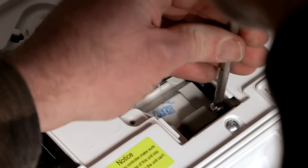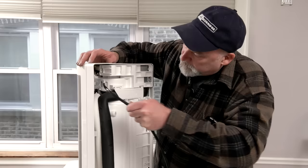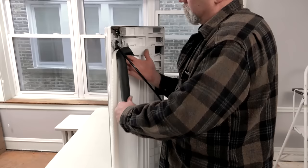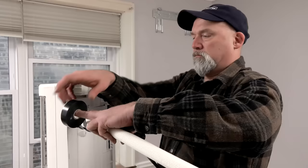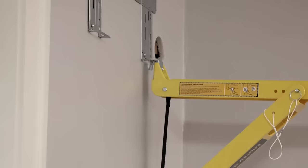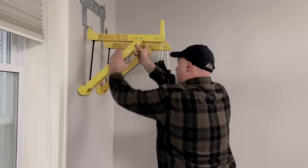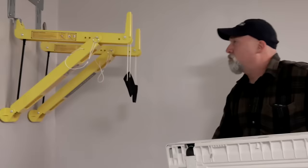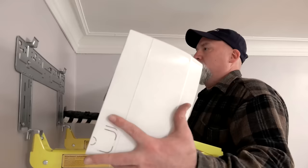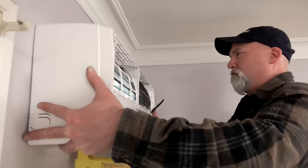Prepare to install the control wire by removing the wire cover and wiring clip. Push the color coded multi-conductor wire through the inlet hole on the back of the air handler and pull a few inches through the front. Leave the cover open — you will make the wiring connections later. Now carefully unfold the refrigerant pipe, making sure not to crimp the copper tube in the process. Bundle the control wire, refrigerant lines, and drain tubing together with electrical tape to make sure it will fit easily through the wall. Lift the unit into place and carefully pass the bundled pipes and wires through the wall opening. Place the air handler on the wall mount, making sure it is firmly secured and your refrigerant line, condensate tube, and electrical cables are completely through the wall.